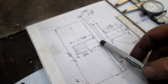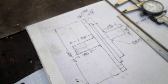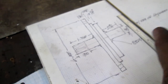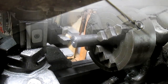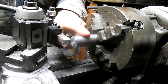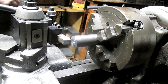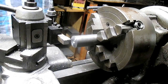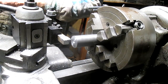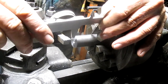And then our distances are 1/4 inch, 150 thousandths, and 1/4 inch. Now I just took some rough measurements while the customer was here. So let's get some more accurate measurements. Alright, so we're going to take this 4140 and we're going to trim it back about 1.5 inches or 1 3/8 inches. And let's measure that. 375, and that's about where we want to go.